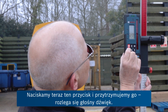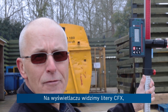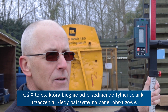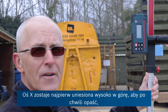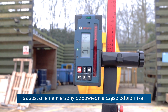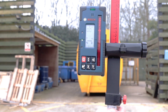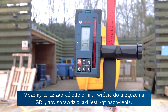We're going to press that button and hold it. On the display we have the letters CFX, which means centre find on the x-axis — the one coming directly out of the front and to the rear of the unit as you look at the control panel. It's not affecting the y-axis at all. It's simply lifting the x-axis first up very high, and then it will start to come down until it finds the receiver and locates the centre — which is done already, quite a quick operation.